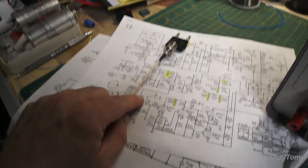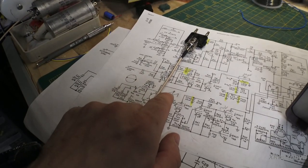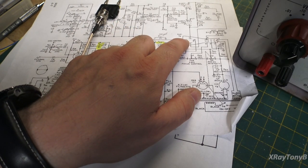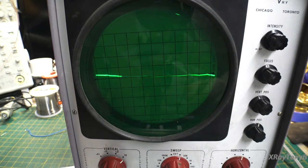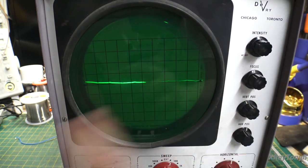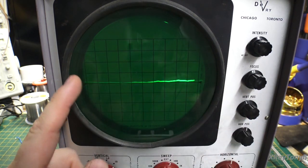So when this ramp generator is down here at the bottom, the dot is at the edge of the screen over here. As this ramp increases in voltage, it increases the voltage on this circuit right here, and it moves the signal from one side to the other side, it deflects that dot from this side to this side. If I had a perfect balance of voltage in between these two, the dot would be right in the middle. Okay? So all we're doing is just repeatedly sweeping this dot back and forth. So we're just giving an element of time so that I can paint a picture across the screen.